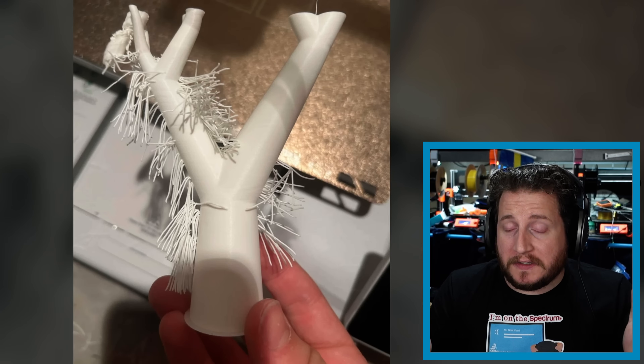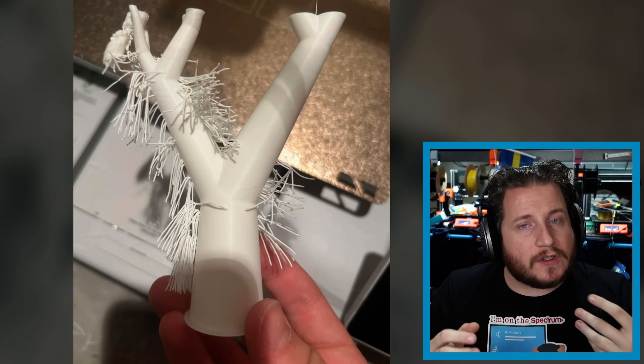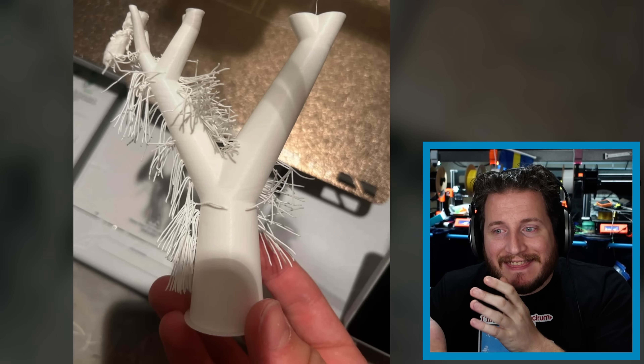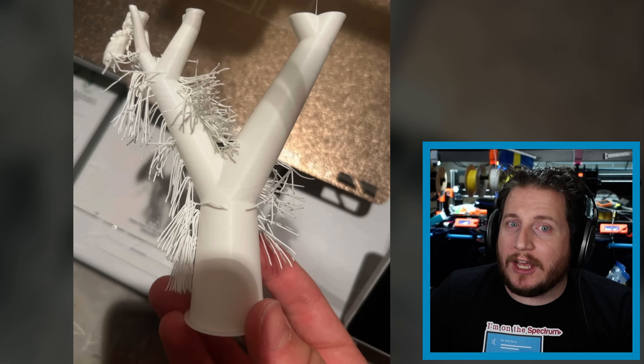The first thing I would check is to make sure the print file itself is actually clean and there's nothing wrong with it. If your print file has any damage — it's corrupted, the G-code's messed up, or the STL file needs to be repaired — you could see the machine trying to fill in those holes or dealing with bad code by just drawing straight lines. This is not from wet filament. The material itself looks fine. All we see are these thick strands that appear to be the exact size of an extrusion from the hotend itself.